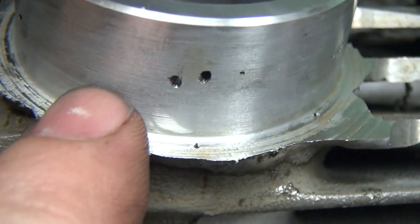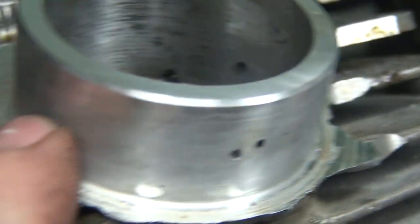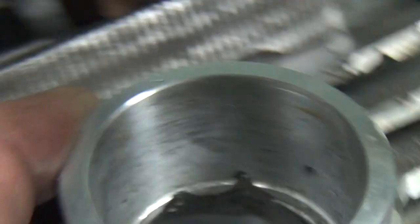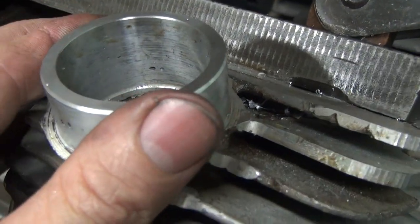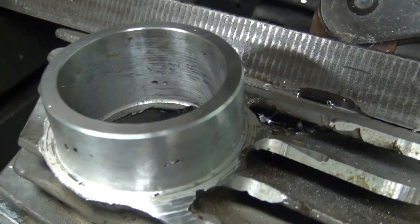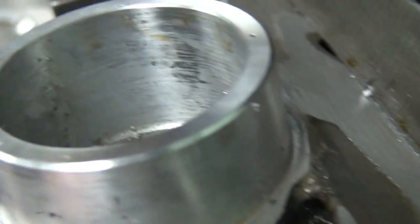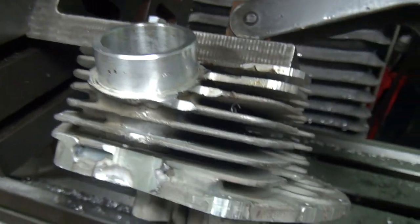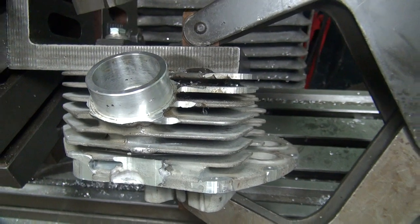I don't like that, but oh well — you get what you get. Here's a couple little pieces right here and one little one right there. On the inside we've got a couple floating around in there. Everything else looks pretty good all the way around. When you weld contaminated aluminum, if the welder doesn't weld it correctly and doesn't burn all the crap out, you get porosity — so that'd be me. Usually I do a better job; I don't know why this one's so bad. This head probably had a lot of contamination to burn through — that happens. Alright, so we've got this one all done. I'm going to take this out and move on to the next stage on this head.